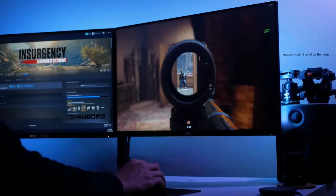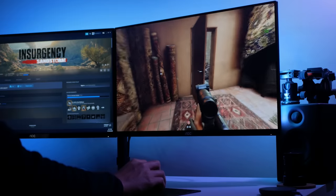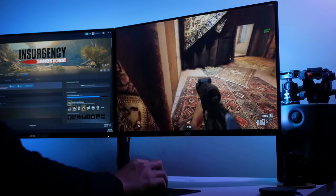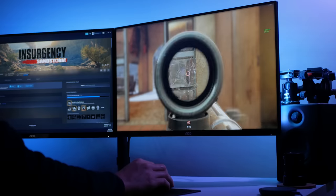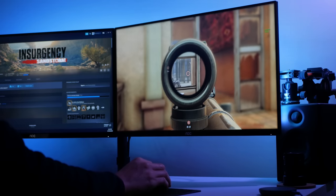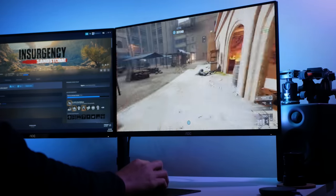And that's my upgraded 1-2 Mini. I hope you liked it. It's a lot of work, but if you disregard the keycaps, it's not actually that expensive. With a normal 1-2 Mini, so not the HyperX version, it would be much easier to desolder because it has SMD LEDs, and you don't need to desolder those, but do at your own risk, you can potentially wreck your PCB, and warranty definitely won't cover that. The paint job bit is totally doable though, if you're game to take it apart.